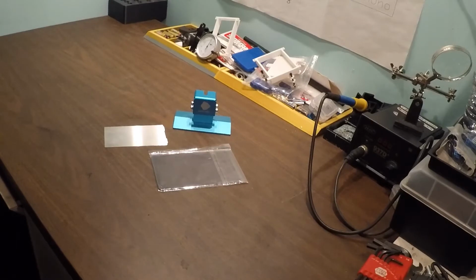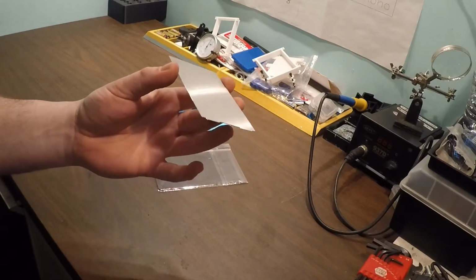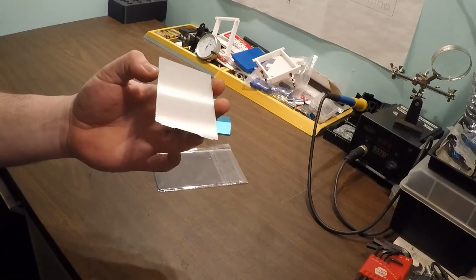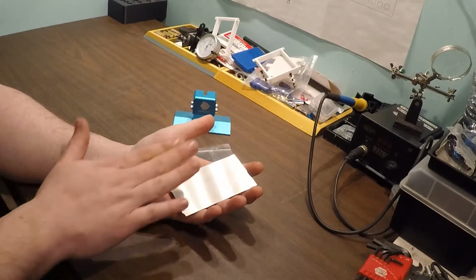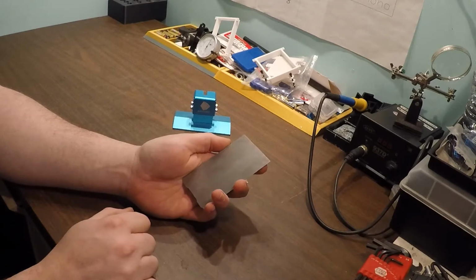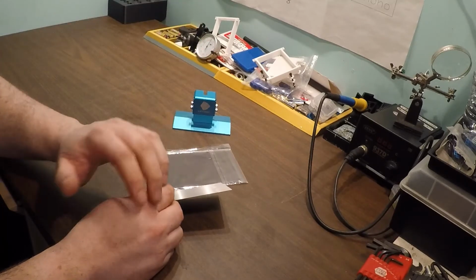Alright, we're back. Got that designed and in the CNC machine and cut out, and really, I can't be happier. A little bit of a pain in the butt to cut this, but really not a big deal. I should have gone around the fixturing a little bit better. Good trick is to put blue painter's tape, as you saw in the video. That's what was on the back of it, just so it didn't get scratched up. But what I really should have done was blue painter's tape on the flex plate, and then blue painter's tape on my actual spoil board, which is just another 1/8 inch chunk of aluminum on the bed of the CNC.